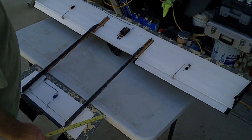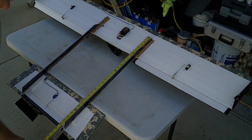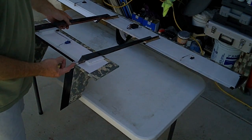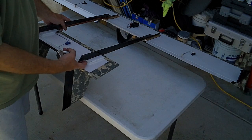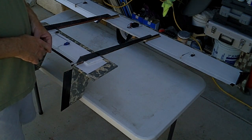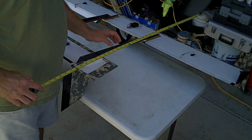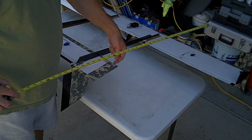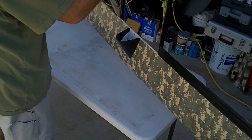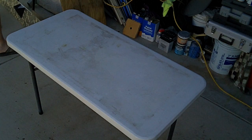So we've got that. We've got the span width. The overall length of these booms are 28.5. And I've taken the boom all the way to the trailing edge. Is that necessary? No, it could stop about two-thirds in, give or take. Just the critical number for proportion and arrangement is that this is 24 inches from that leading edge to this leading edge. Okay? Enough about the fuselage. Let's set this aside. And this is very lightweight. This is maybe a pound and a half, something like that.